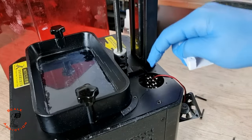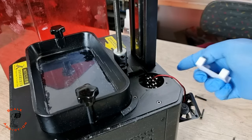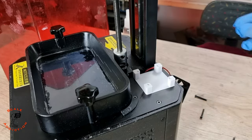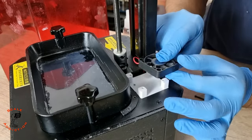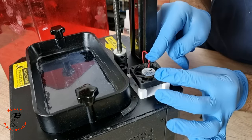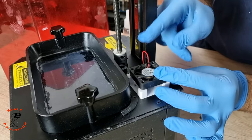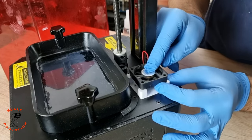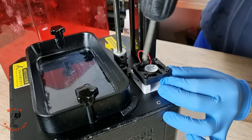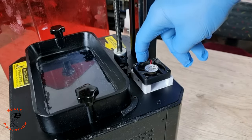Okay, the fan used to push the fume inside the 3D printer and then pushed it out. There is another fan over here, but what we're gonna do is block that hole like this, and the fan will be here. My idea is: the fan was like this, I'm gonna turn it so it can push the fume inside the filter, because these fans work better when pushing air rather than with suction. So it's gonna be like this, and I'm gonna install the stock bolts and the access wire just pushed inside the 3D printer so it doesn't get in the way.